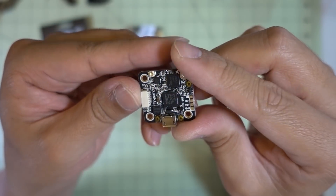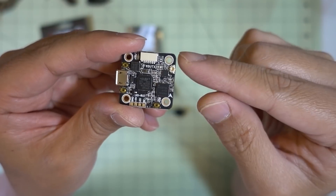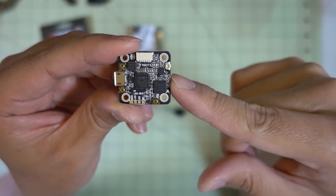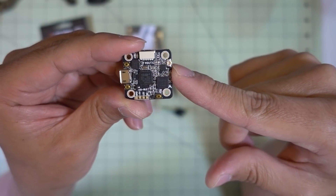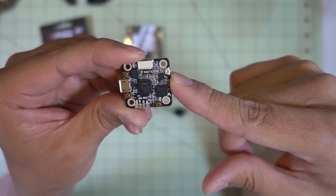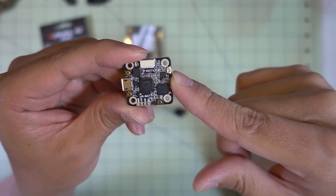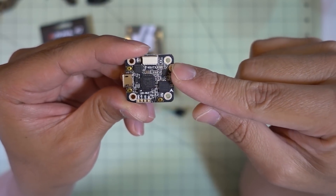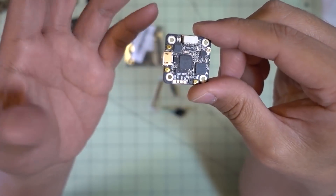This is a very nice combo board. The video transmitter works really well. I've heard some people having issues with reception, but in my flight demo I went clear across a park about 200 meters away and got very little breakup even on 25mW. They probably just didn't connect the antenna correctly or had a defect on their particular model, but mine was working fine.